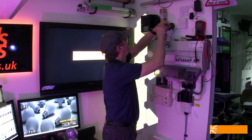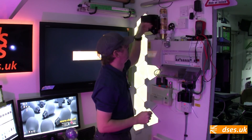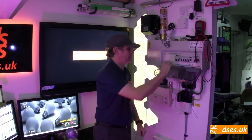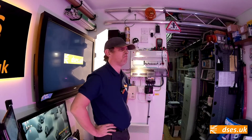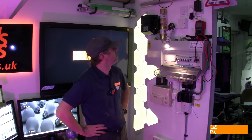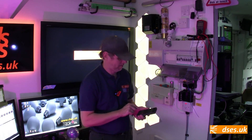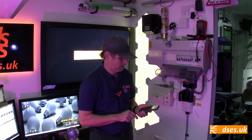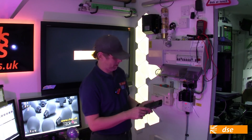I do have another higher value resistor — a 7.5k at half a watt. With it in circuit, our nuisance glowing light has gone. I should be able to fire this up now without any zappy fireworks... Oh, it's that fishy smell. 230 volts over 7.5 kilohms is 30 milliamps, which is 7 watts through a half-watt resistor — I've effectively just made a little mini heater. I really should do the maths before connecting these things up.